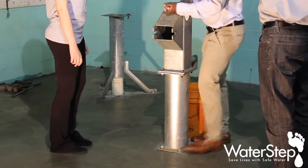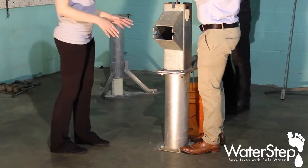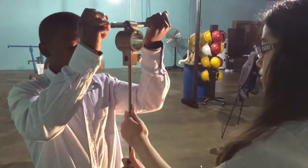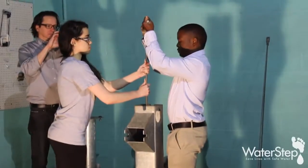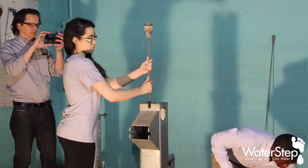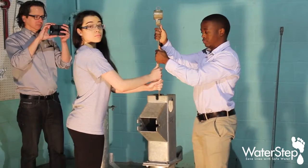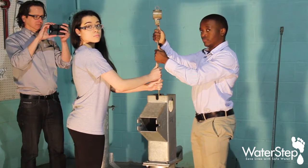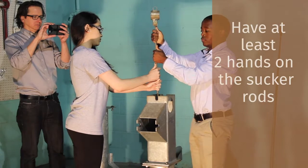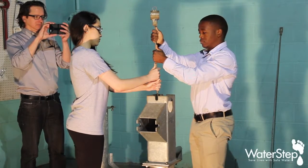You may have to pull up a little bit to get it started. Then have your person working with you grab hold of the sucker rod with both hands, slide the wrench out and lay it on the ground so it doesn't fall. Safety is real important because you don't want that wrench just to hang up there. You always want to make sure that you've got several hands on these as you're pulling them up, because the last thing you want to do is drop this back down the well.